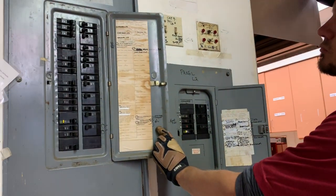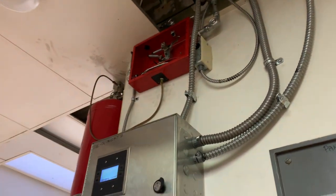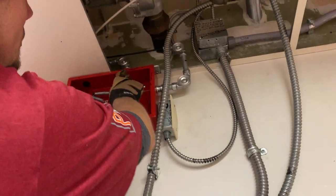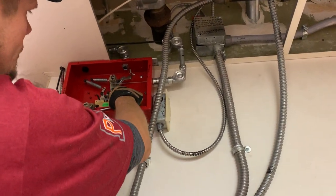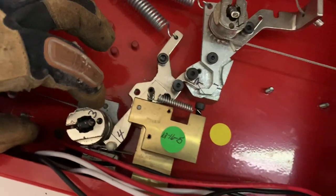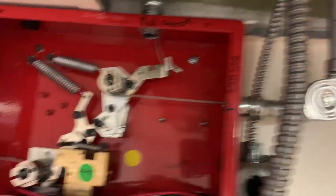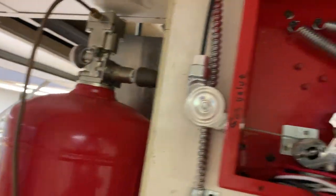We also have the label in here — a lot of circuits that were mislabeled — and up there's our Buckeye. So we actually relabeled. This pull station pulls, it releases, and then you have to coil-wind this up to get contacts one and two here to connect. Then once that connects, you reset three and four here, and once that winds up it will click and lock. If this releases, this is going to be your link line, and this goes to your gas valve.